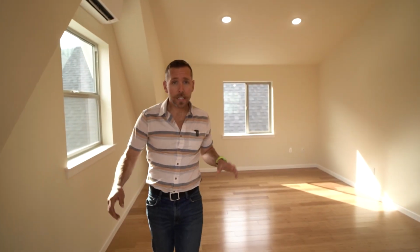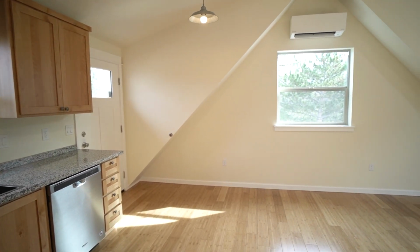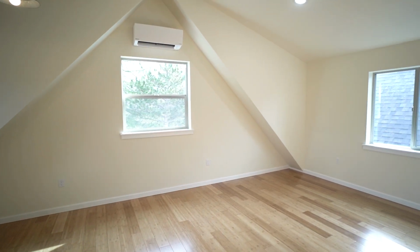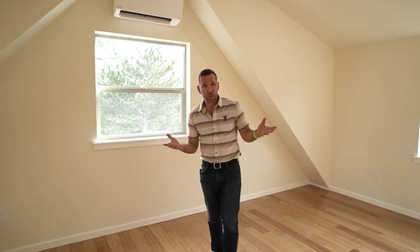So as we come into this ADU, you're gonna notice a lot of the same principles that I talk about on all my builds. We have a large vaulted ceiling. This is almost 12 foot to the top. Hard surface flooring, I always use hardwood. We wanna have big windows, especially on our south and west walls where the light can pour in. The way we make a space feel bigger is with volume, so tall ceilings, and with light. So those are some basic principles.